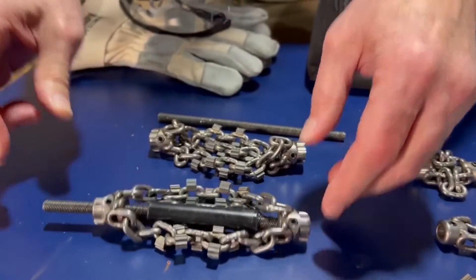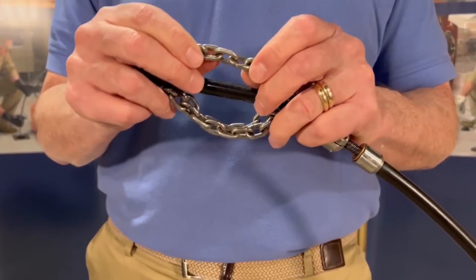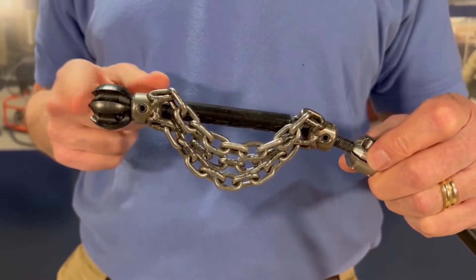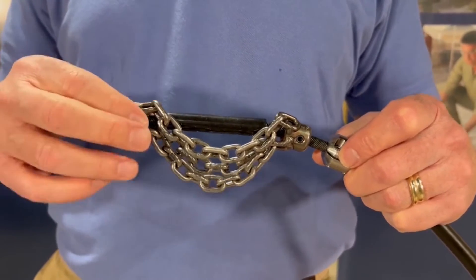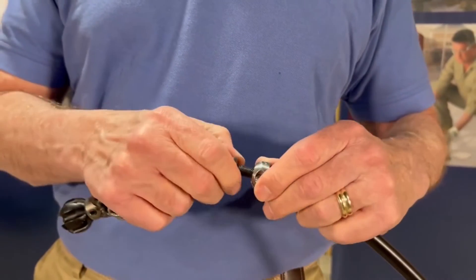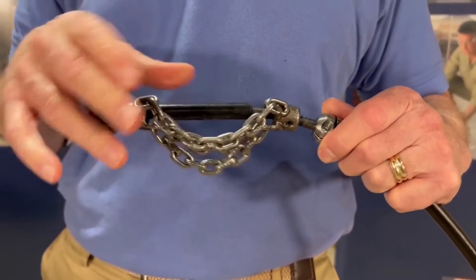We have another chain cutter set up on the machine itself. You'll notice this chain cutter is smooth — it doesn't have the carbide tips on it. This is designed for PVC or plastic. It has a clog chopper on the front end. The way you put this together is you put the clog chopper on first, again using the mid-sized allen key, and then put the first adapter right up against the clog chopper. Leave a little bit of room between the rear coupler and the flexible shaft coupler on the front end of the flexible shaft. It still has a sheath on the inside.